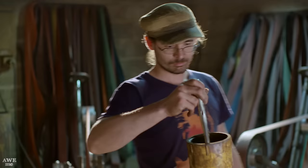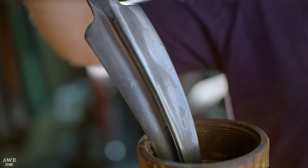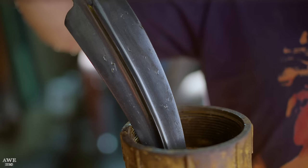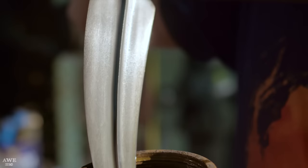Getting to be the first one to see these blades out of etch is such an honor — this pattern is beautiful. Normally when we fold steel together or forge-weld several different types of steel, you see a pattern that results from several alloys etching at different rates. Here, in crucible steel, the pattern consists of a carbide lattice trapped in another steel lattice. It produces a much finer pattern, and that is the original steel that was so sought after in medieval times as well as in the 19th and early 20th centuries.